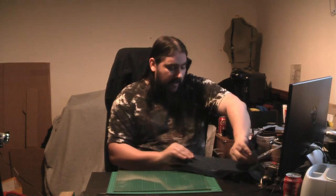It's really simple. You just make sure you get enough resin on there first, and you put your fabric on upside down and then layer it up, as we'll do in a bit, and there you go. And once it's dry, you will literally just crack it off the glass and you will get a perfectly mirror smooth top. So that's what we want to go through here.